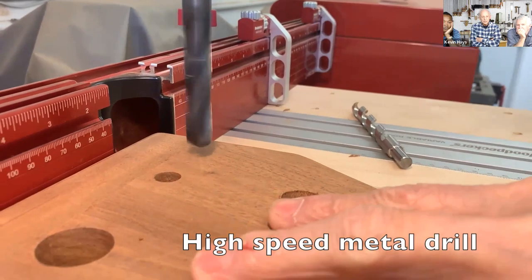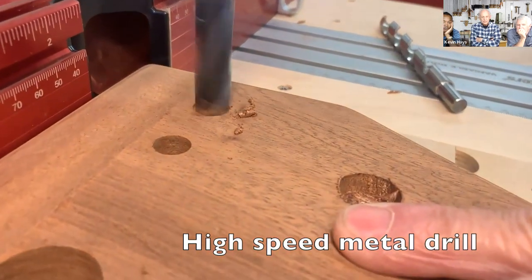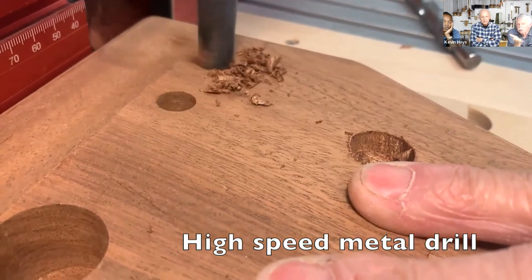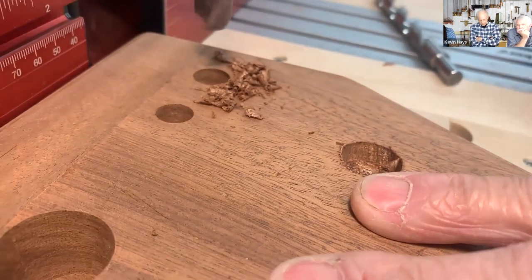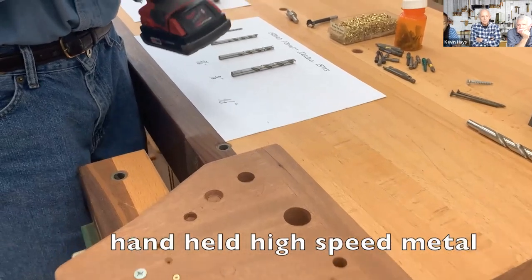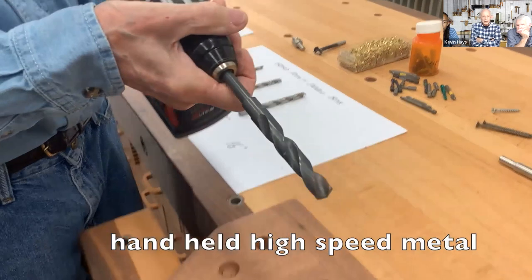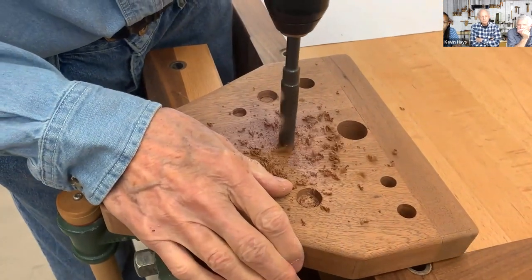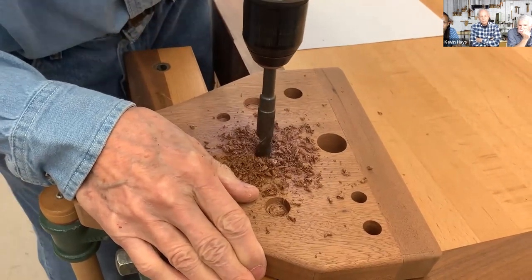And here's a twist, just a standard half inch drill bit. In a drill press, it works okay, but in a hand drill, well, you'll see, we actually do it handheld. It moves around on you. I have a complete set of just standard twist drills, and the beauty of it is if I want a drill bit that's 0.139, I have one. Now here's the same drill bit handheld, and I'm not doing that deliberately.